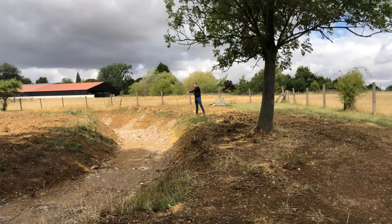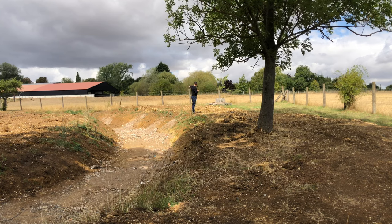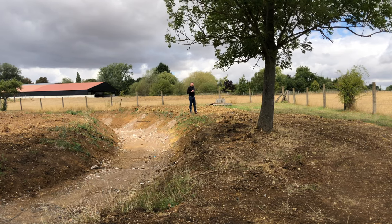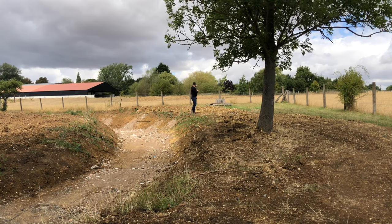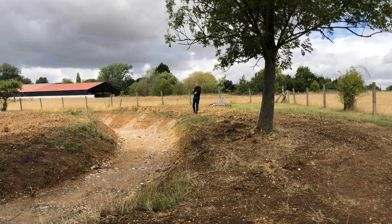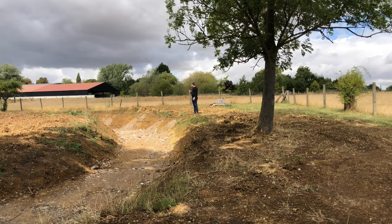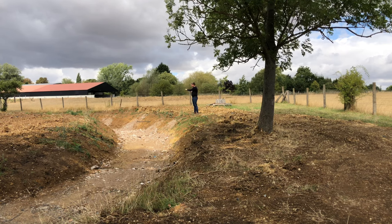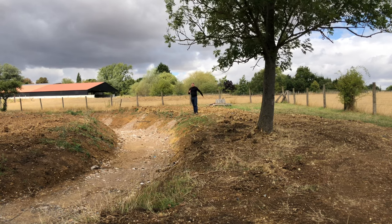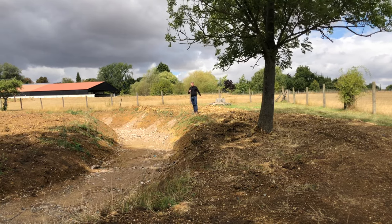To get this dry and keep it dry during the winter, we've basically done an outside loop — a deeper version of the land drains, but much narrower. We put the pipe in through it, and hopefully any water coming in from the fields above will hit that first and be diverted around the cutting rather than ending up in it. The cutting is a nice straight level now, so any water in it will also drain out — we've put a drainage pipe into the bottom. We've double-protected it with this outside land drain.